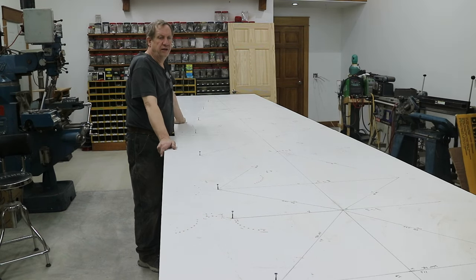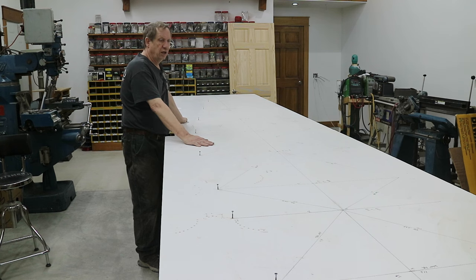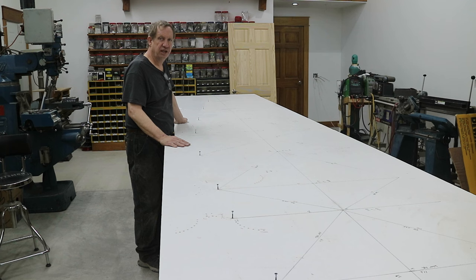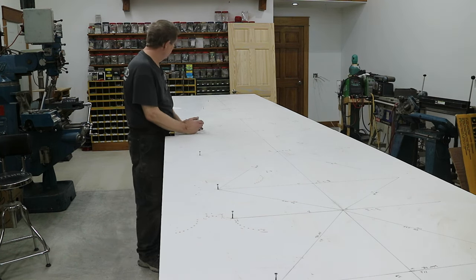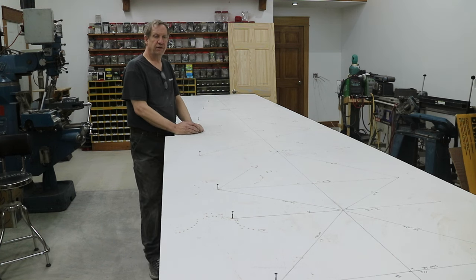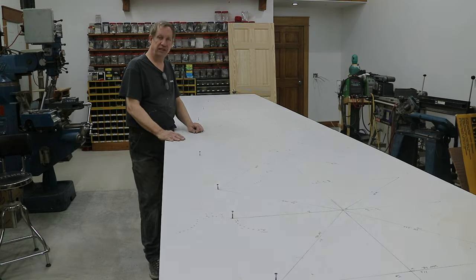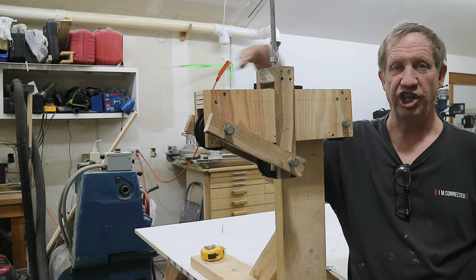So I finished laying out the plans for the bottom fuselage, and now it's time to bend these longerons on the outside. Basically, from station E, which is right here, backwards is a long flowing general curve. Forward of that is a bunch of straights. This is what I created to bend the longeron, that long general curve.